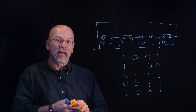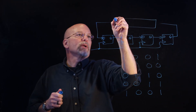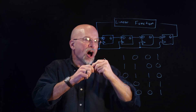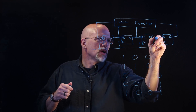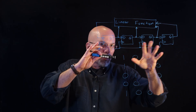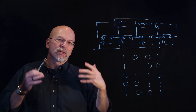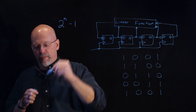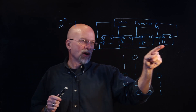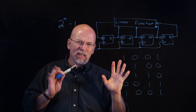When we were talking about a linear feedback shift register, we started by inserting a linear function in this feedback loop, made of exclusive ORs. We tapped off of intermediate values — not all of them, but the important ones — and always took the value from the least significant position. An exclusive OR with the proper taps could give us a period of 2 to the n minus 1, where n is the number of bits in our shift register. The minus one was because the all-zeros case is not valid — exclusive OR of all zeros gives zero, locking us into a period of one.